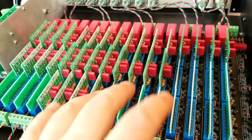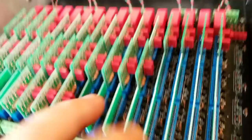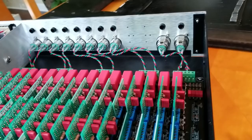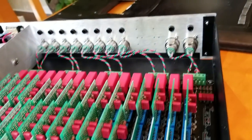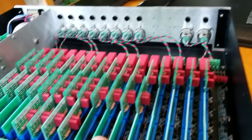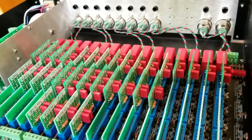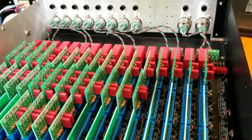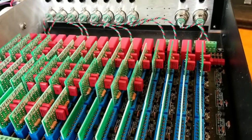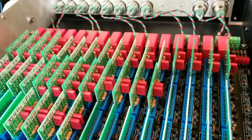This is as legit as it gets. I wanted differential for noise rejection, and I also wanted to stay balanced all the way through the circuit from front to back. Normally you'd come in, convert to single-ended across the board, then convert back to XLR on the way out. That whole conversion can be avoided if you just leave everything balanced and differential throughout — never having a conversion. That's pretty cool.